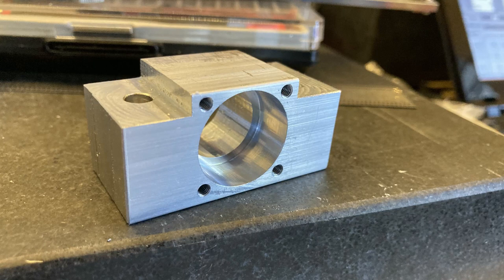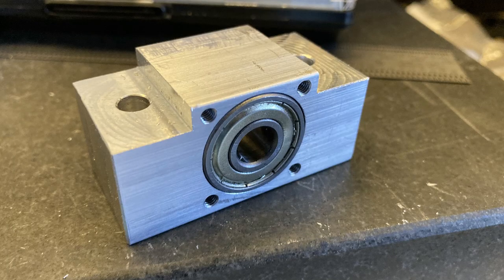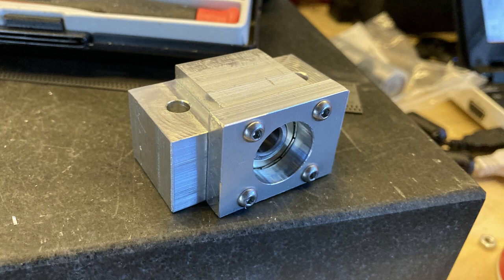The bearing block is a little more complicated than with those other flange mount bearings. The way that I made it, and still had it low profile enough to fit underneath the table when it moves over to maximize my axis travel, required boring a hole where the bearing's going to sit with a little lip on the inside where it steps down to a reduced diameter. That constrains the bearing from coming out in one direction. After putting the bearing inside so that it's constrained from any translation in the radial directions, I then put a little plate on top that's screwed in, constraining it from moving axially the other way. The bearing sits a little proud outside of the bore, and that ensures there's no backlash — the bearing can't move at all. It's fully trapped where it's at.